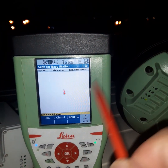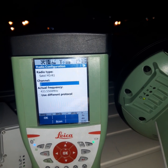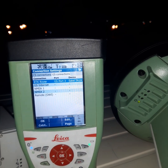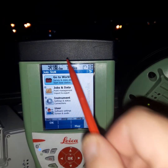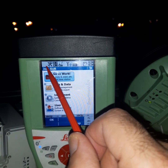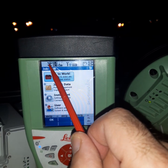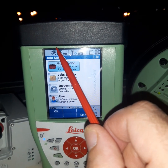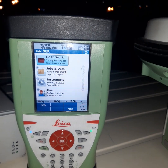Now the radio is confirmed OK. However, we noticed the position is still not appearing. This is because we have 13 satellites visible but only 3 are active. The reason is the antenna is not pointing up — once we raise the antenna, we should see more satellites and the position will appear.